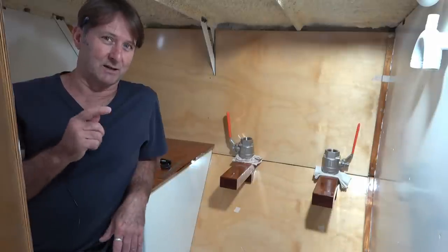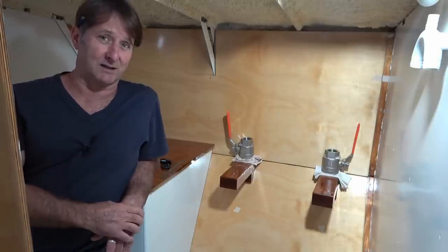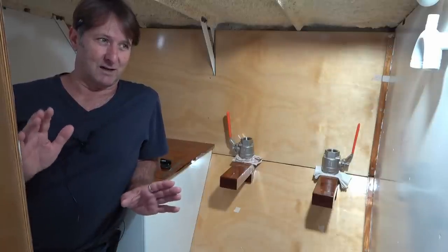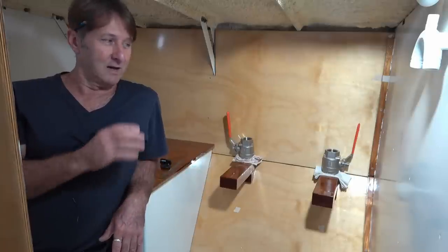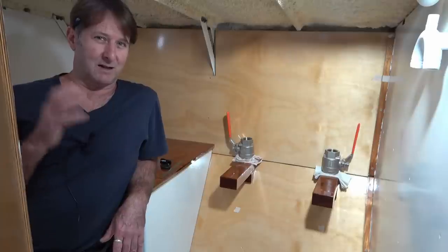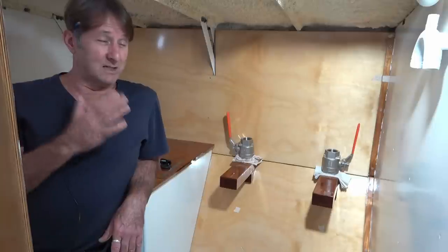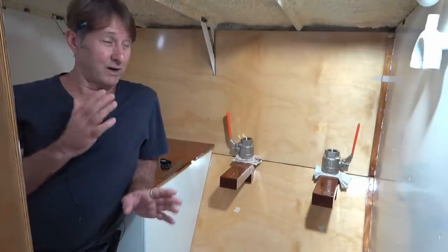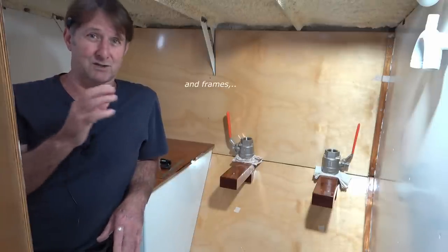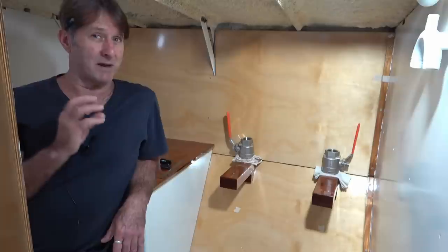And what I'm going to do for that is I don't want to permanently bond them. Something that some people may not understand is in terms of how to install things, going right back to the original fit out. Some people really don't want to cover the hull. They want to leave that open. Others fully close it up so that if you wanted to get to the hull, it involves wrecking things. What I've done here on Mistress is I've gone kind of in the middle. I did want to insulate Mistress and also have lining so that I could mount things from the lining itself rather than have to rely on the hull and brackets and re-welding bits and pieces. The plywood lining is a surface that all sorts can be mounted to.